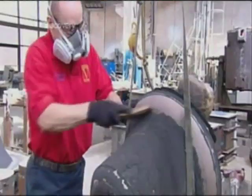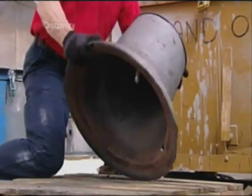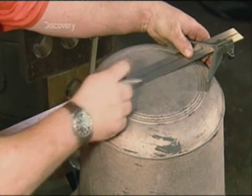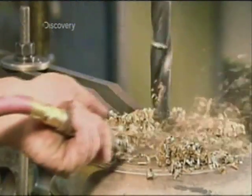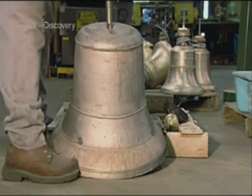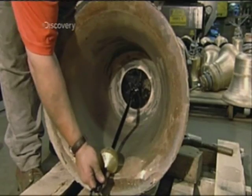The extracted bell is covered in a residue of burnt epoxy. They remove it with a wire brush. Then they disengage the gate with one well-aimed strike of a sledgehammer. Now they mark the exact centre point of the bell — that's where they'll install the hardware from which the bell will hang. They drill a small hole, then gradually drill it larger and larger. They can't bore a big hole in one shot because the friction-induced heat would crack the bell. They tip the bell on its side to hang the clapper, the proper term for the bronze hammer inside.